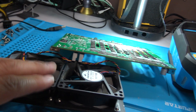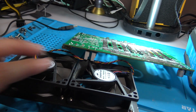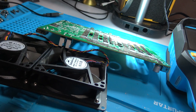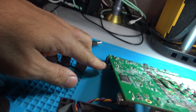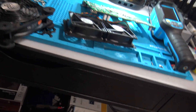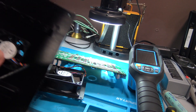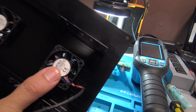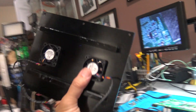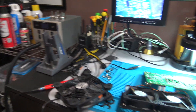Something is wrong with possibly the fans - this isn't the fan that belongs to this unit, I'm only temporarily using it. I grabbed some other fans, plugged them in, and the lights came on. So I think it is the fans - one or both of them are blown. I'm suspecting the burning smoke that originally came out was from one of the fans, because I could smell a little burning on one of them.